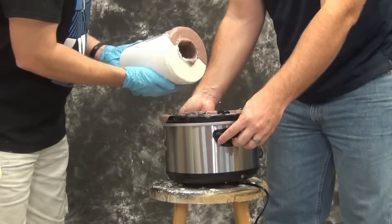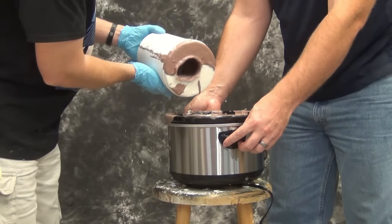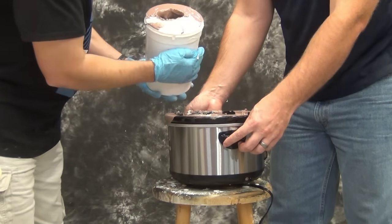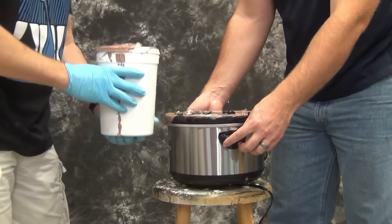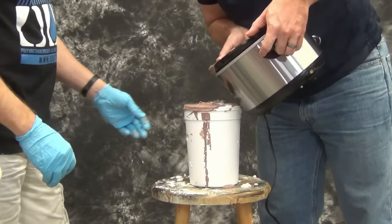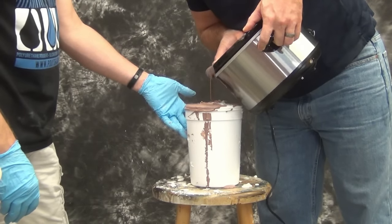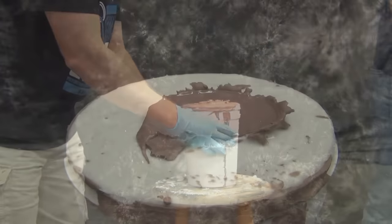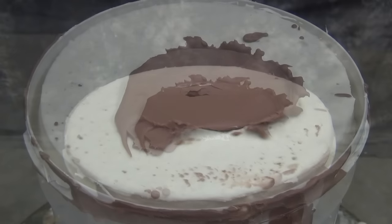When pouring this hand up, I always like to pour it in and rotate the mold around, pour it back out, and then fill it back up again. We're going to pour up this hand solid, but I always like to first pour in a little bit of a slush coat, slosh that around, and then fill it back up. By turning the mold around as I'm emptying it out, that helps eliminate any air bubbles on the sides of the pour. That's especially important with hands, because there's a lot of chance for air bubble entrapment around the fingertip area.